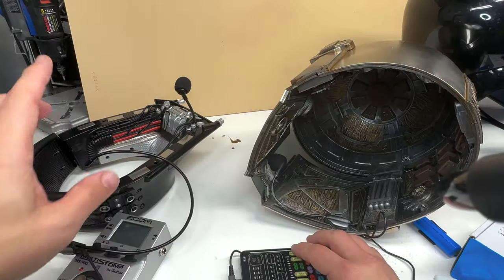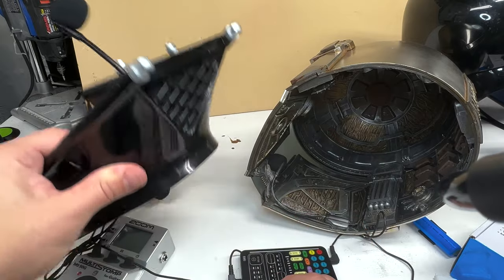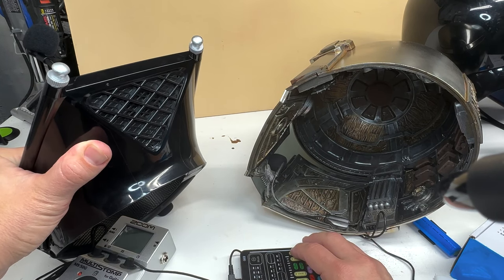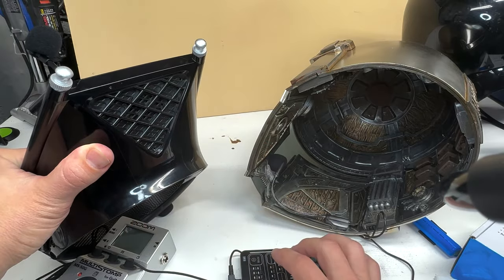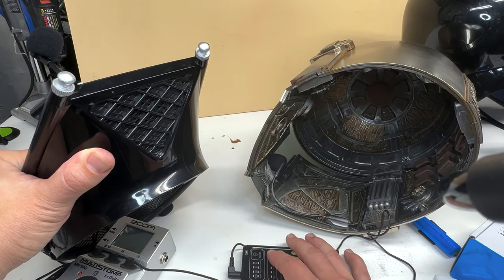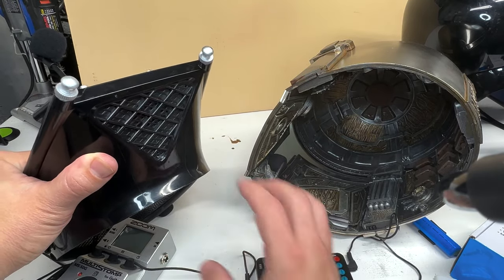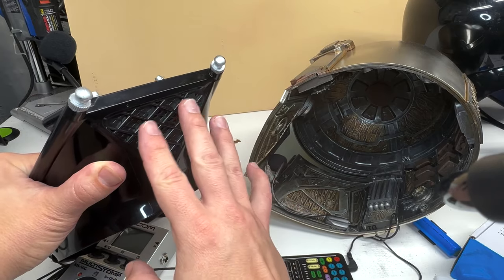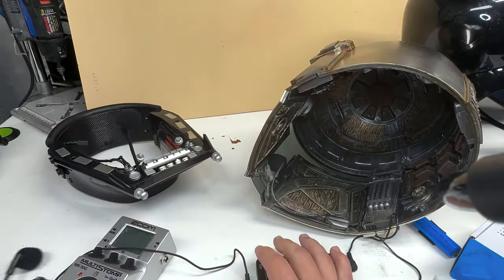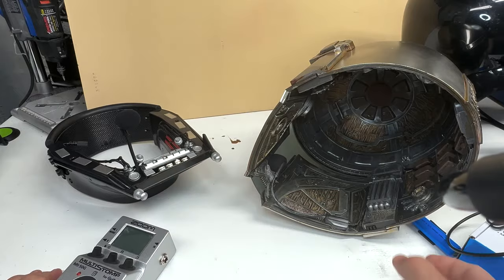What I noticed with this one — I don't remember the exact wattage — but when I was outputting to the built-in speaker it gave me very low volume. I realized I'd wasted a lot of time pushing to this speaker only to get a low volume return. What I did was use something like Audacity or whatever your audio editor is and jack up the decibels. On this one I jacked them up to almost 18 decibels, and it made a huge difference — from a faint sound to an actually audible version coming through the speaker. When it comes out the top speaker it's phenomenal. Use third-party programs to increase the decibels on your original media files to get the volume you need if your board is insufficient.